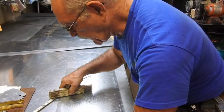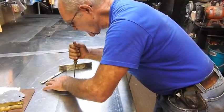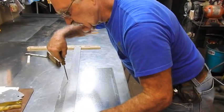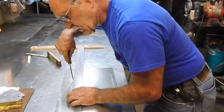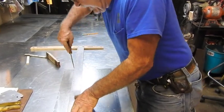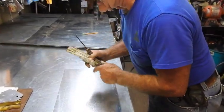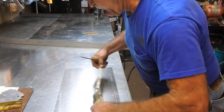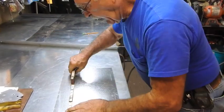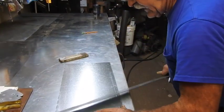Now we're going to come one inch back off of that, because that's going to be down in an S, or it'll form a drive. So nine and a half minus one. That'll be the cut length. This will be the one-inch-down line where you form your S or your drive cut — the part you actually measure to. Half of 17 is eight and a half, so you go eight and a half here, and on the one-inch line down, eight and a half here. Double-check: 17 all the way across. Connect those dots.